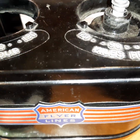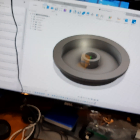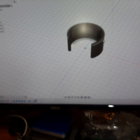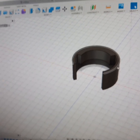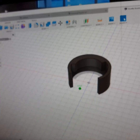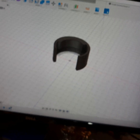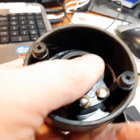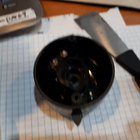He chipped off another piece on the inner flange, but I've made what I'd call a tooth repair. Called it a throttle bushing repair - it's going to slide onto the existing part and fill that notch that's broken out. It's like chipping a tooth and then putting a cap on it. I'll fill that notch, and a large part of the original is still there, so I'll be reinforced by wrapping around the rest of it.